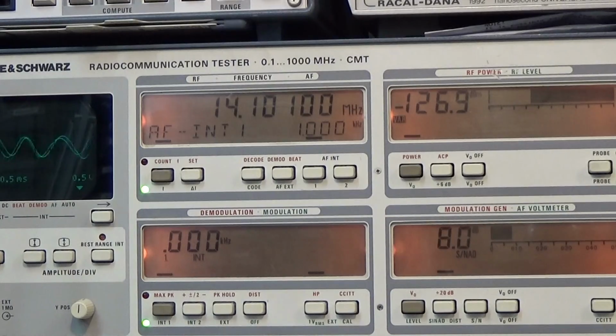So the transmitter power is approximately around 130 watts, so that is okay. As you know, this is only because the old man has to drive an old tube amplifier, so okay, that's fine. And third, our receiver sensitivity is great, so that is close to sensational. So that is incredible. And we have checked our S-meter performance, so that is good as well. And therefore, I would say we can give the radio back to the old man.